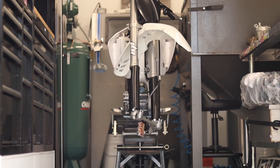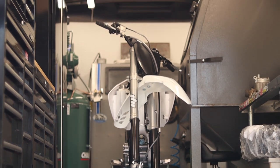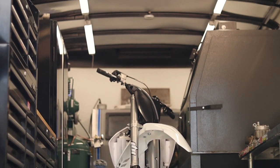So you don't want to accidentally buy a three phase commercial compressor motor if you are working out of your house. And for reference, all houses and residential areas are single phase. So you guys may have noticed I don't have any loose air lines or crazy water pipes running through the trailer. And that is because it is all plumbed below the trailer.